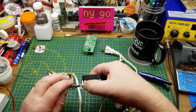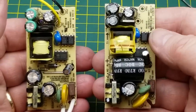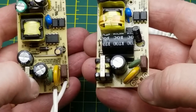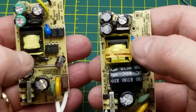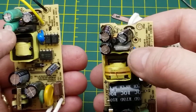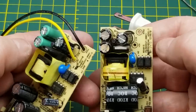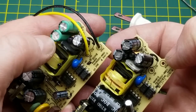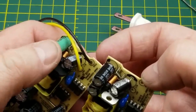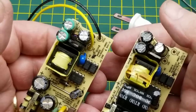There's the second one soldered down. The circuit layout is slightly different — two of them have one layout and one has another. The big capacitor is different, the MOV is sitting at a different angle, and the transformer looks a little different. The dual diode labeled D7 has heat shrink over its heat sink tab. The board numbering in the corner is slightly different, and the capacitors are different brands — likely just from different production batches. Nothing that should prevent them from operating properly.